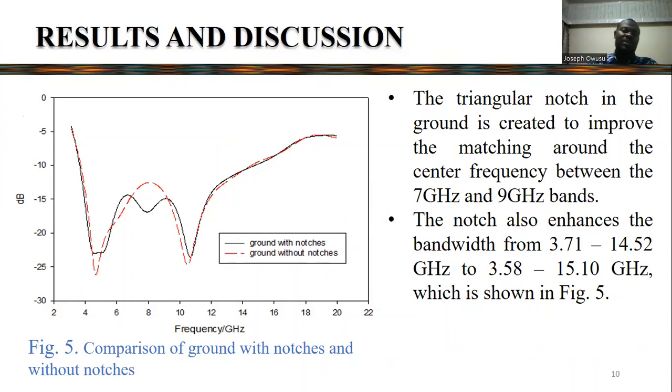And it's also important to note that this needs to be optimized such that we don't have leakage from the partial ground plane, because of the surface current; if we don't compensate that well, it means we are going to have a mismatch. So we have to optimize this carefully over time to obtain the parameters of interest, giving us the wide bandwidth with the matching that will give us the operation in the terrain with the optimized parameters.